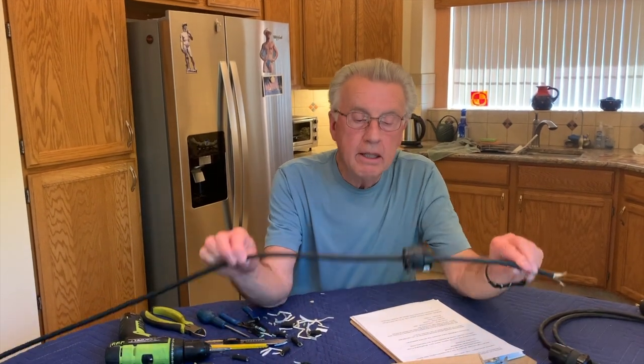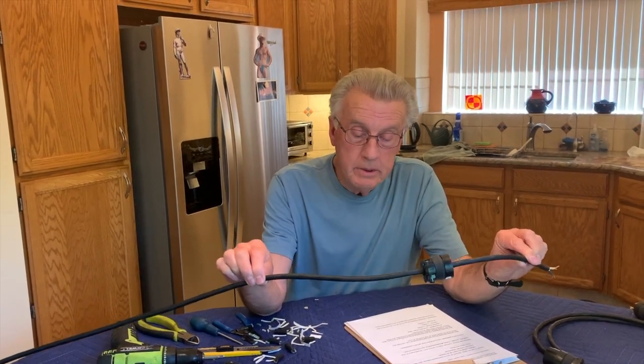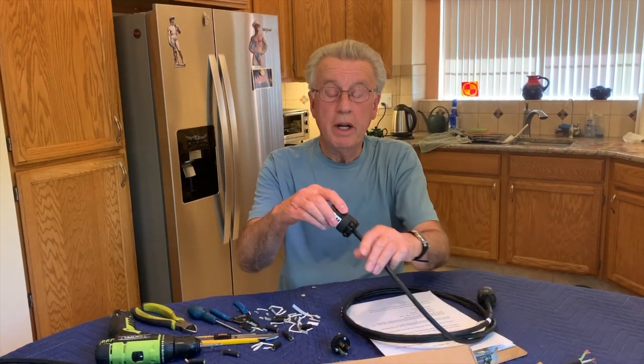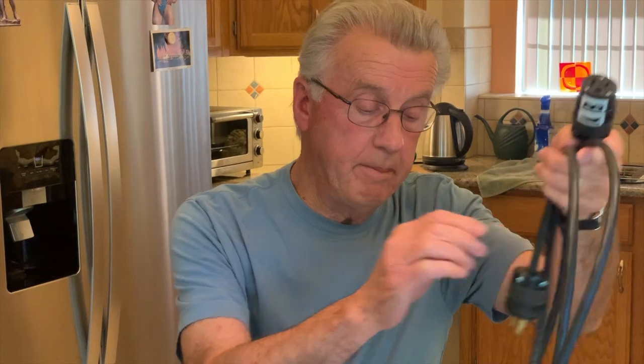The cables I'm making are black — that's important so they can't be seen overhead. Heavy duty. Custom length. They have connectors that'll bounce and not break. When they're finished, they look like this. One end has a label — this one is circuit AB, which means where it winds up overhead is going to be between circuits A and B. The other end is marked 6AB, which means it will be on electric 6, circuit 6AB. And the lighting design teams will call that either something like Baker Charlie or Buttercup Clover, depending on their method.